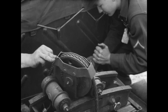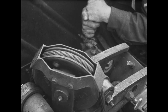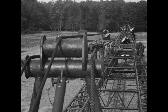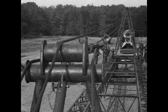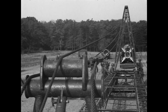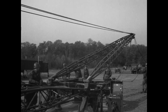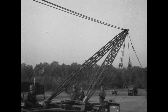The crew will now engage a cable traveler mechanism to precisely wind the steel cable onto the winch drum. The 10-ton capacity winch was then operated to pull the rotating A-frame assembly to the vertical position. The block and tackle rigging seen here, suspended from the apex of the A-frame, was used for missile assembly.